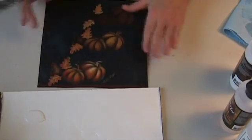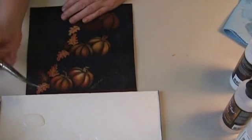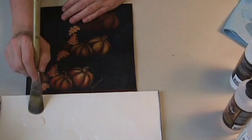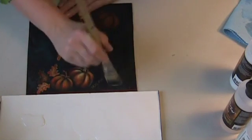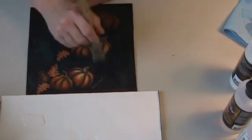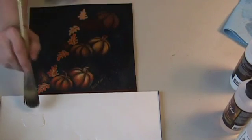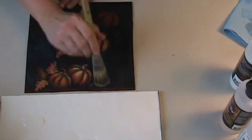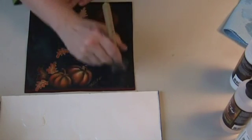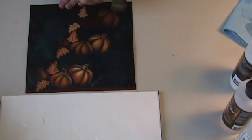Alright, so I've got my cardboard here, and it's been varnished once before, but what I want to talk about now is when you dip into your varnish, okay, you've got your varnish right over here, dip into it a little bit, and you start brushing, and things start streaking and pulling because you don't have any moisture in your brush. They're very, very flat. This is when it's a good idea to put a little bit extra varnish and have it be juicier and press down on your whole brush. The whole brush. Work the varnish. Don't just let it sit on top. You actually work it in.